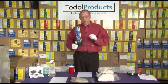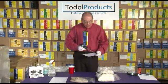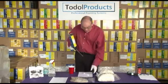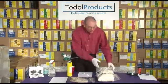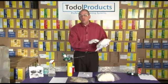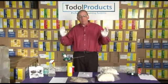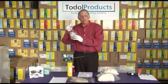The next key component is moisture. Polyurethane resin comes out like a shaving cream and then chemically will grab the moisture out of the air, and then cure. So it needs moisture to cure. In bead form you should be fine, but if you're going to do a large cross-section, you need to provide it with a little bit of moisture.